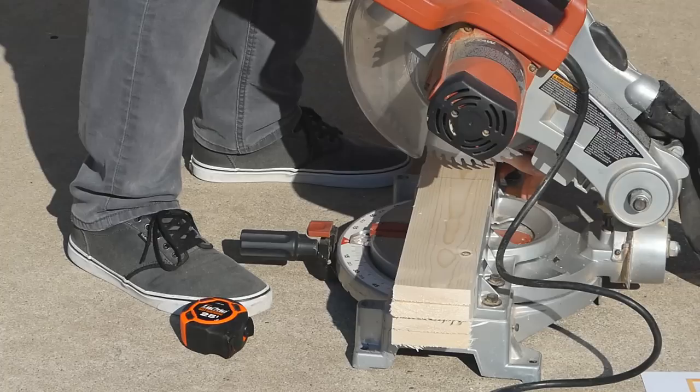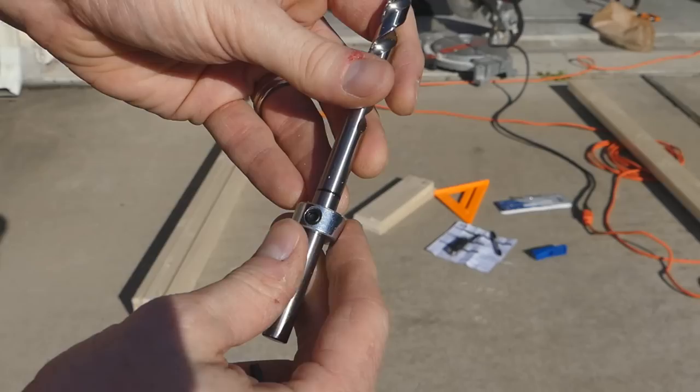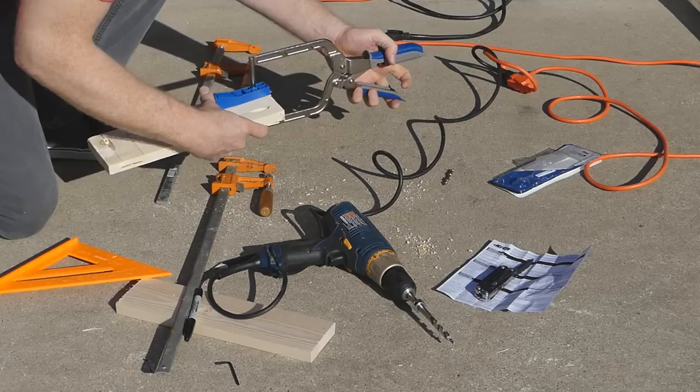Let's say it was 110 inches long from left to right — that's what I wanted. Well, then I'm going to have to add four inches to each side for the wood. And so basically my black borders are going to go on the wood. Here's a close-up of the Kreg jig — it has this little set screw that you put on there that will determine how deep it drills into it. And then this is just a test piece of wood that I was trying it out for the first time.